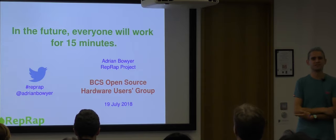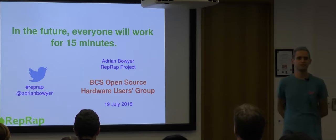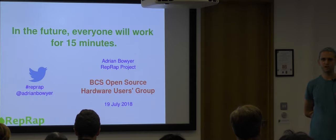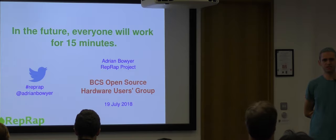Yes. Can you use fixed point arithmetic on an 8-bit machine, or do you need a soft float implementation? So Marlin is using floating point. You can use fixed point, and the easy answer really is to get one of those 32-bit boards and do floating point, I think. Yes, single precision is enough.